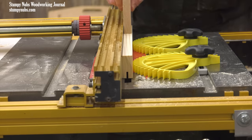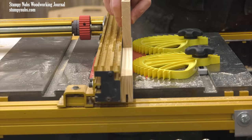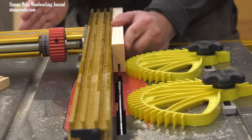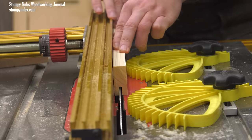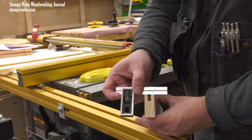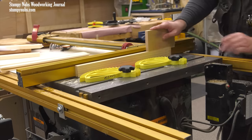Push the workpiece through the cut, then rotate it 180 degrees so the opposite face is against the fence, and run it through again. Do this with all your workpieces — both your stiles and your rails. Since your blade is likely not perfectly centered, that second pass slightly widens the kerf and auto-centers it on the edge of the board. If it's not yet wide enough, move the fence a little bit closer to the blade — perhaps less than a sixteenth of an inch — and adjust the feather boards as well. Then run your boards through again using the same cut-rotate-cut method. Remember, each fence adjustment will be doubled because you're rotating and cutting twice, so small adjustments are best.